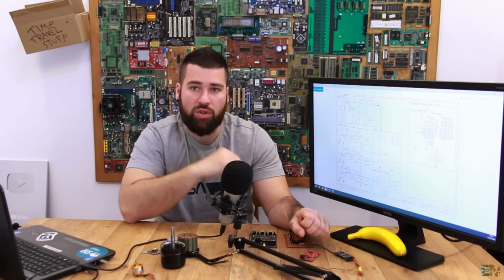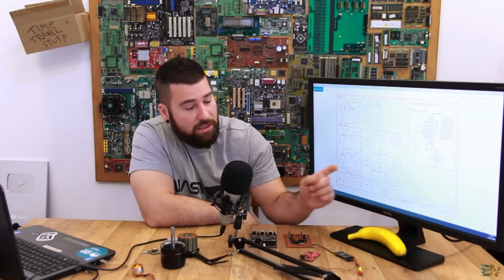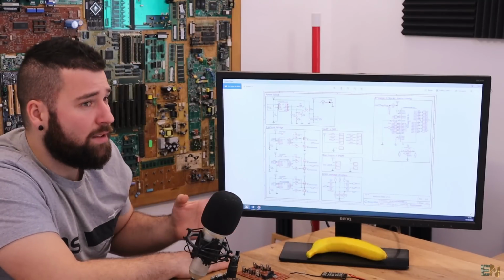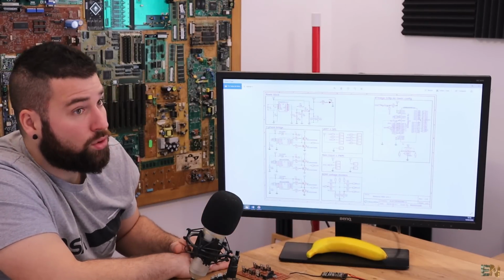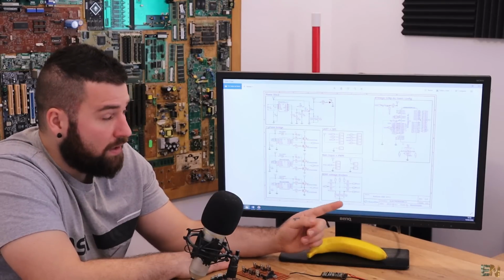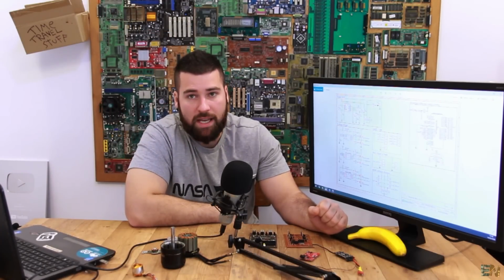But before that, one of the most important parts that you will need to change from this schematic is the voltage divider values. The voltage divider is the same, but the resistance value will have to increase. And that's because instead of 20 volts in this case from the back EMF, you will have maybe 38 volts or even 48 volts. So that will definitely burn your ADC. You will burn the microcontroller. So what you have to do is increase the voltage dividers. Maybe instead of 10K and 33K, you will use 10K and maybe 150K. So in that way you make sure that the voltage coming from the motor is always below 5 volts, so you can read that with the comparator inside of the microcontroller.